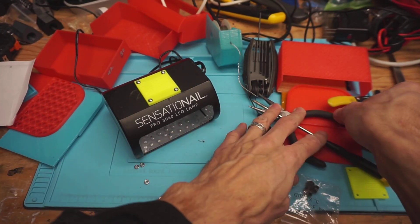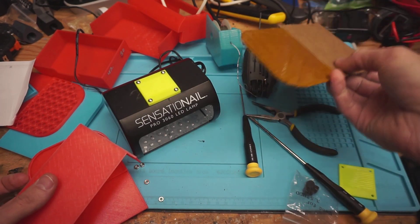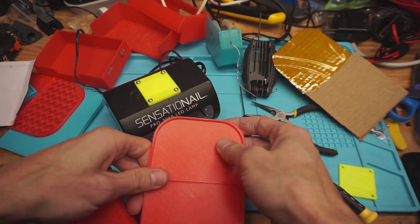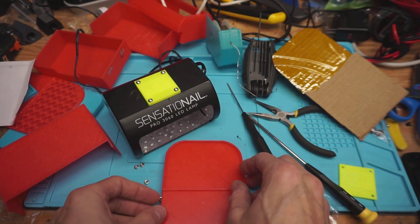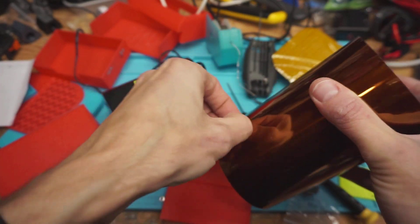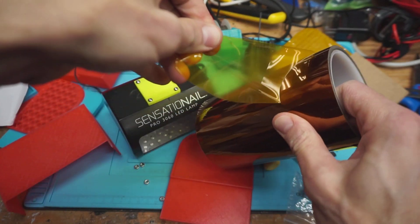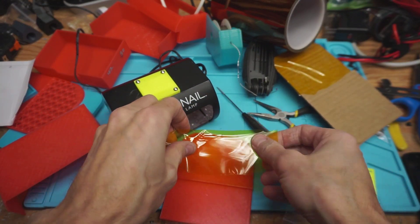So the other items I've designed for this are a tray and a cover. I started off with just a tray made out of cardboard to size it up. I'll also put Kapton tape on it to prevent the sticky resin residue from getting into the tray and the items from bonding with the PLA. I iterated over the design a few times to get it right — it wasn't easy to get the sizing correct on the tray itself.